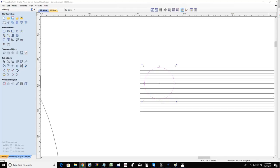You really want to start going through your tool database and adjusting your tools appropriately. Set up those categories for pine wood, purple heart, or whatever, and have all your tools under each of the categories with different settings. That way, when you click that tool for that wood, that's the tool you're using, and all the settings are set. You don't have to do the math and change every single time you choose that bit. Set up the same bit 15 different times for 15 different species of material, because they're going to have different feed rates, plunge rates, and RPMs based on that material.